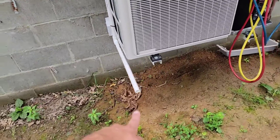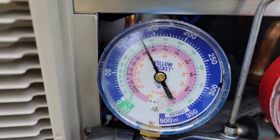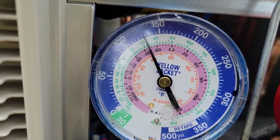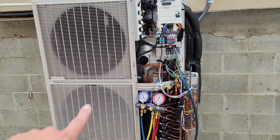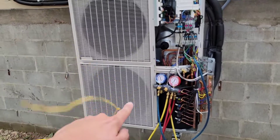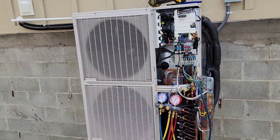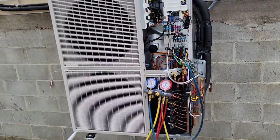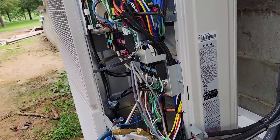We've got some water draining — that's a good sign. The suction pressure is now up to 130. You can see how turning on those additional heads affects the equipment because it's multi-stage, variable capacity. If you try to charge this in first stage, it's not going to work — that's exactly why the manufacturer recommends you always factory charge this piece of equipment.